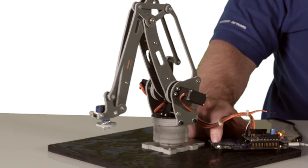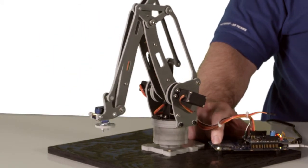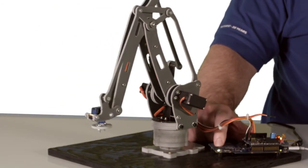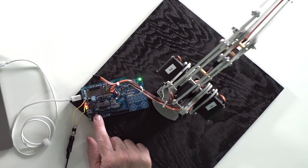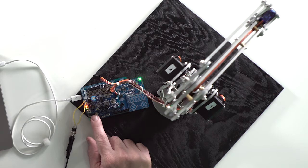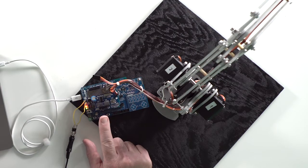For our BLE-controlled robotic arm project, however, I'm going to dedicate the Cortex-M0 Plus core to be the BLE connectivity tasks as well as the security tasks that I'll teach you about in a future video. We'll use the Cortex-M4 core for the rest of the application, and that means driving the servo motor PWM signals. It means reading from the digital sensors, like the motion sensor, and it includes outputting the data to the e-ink display.